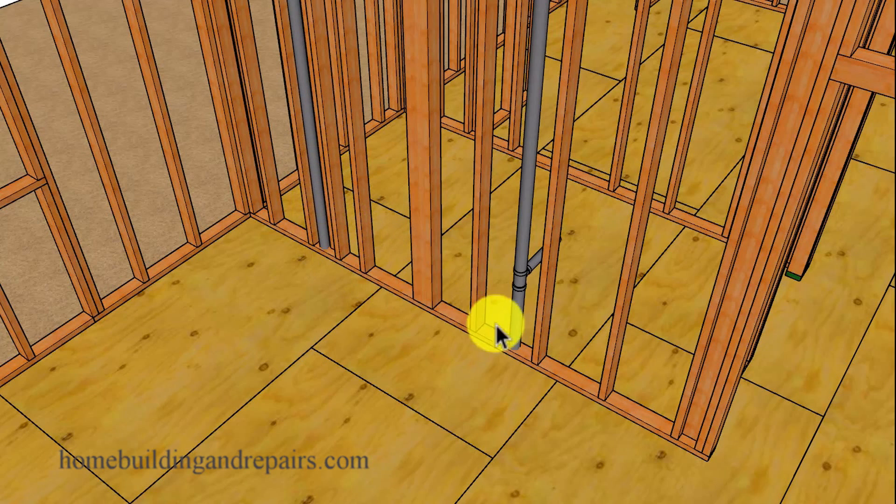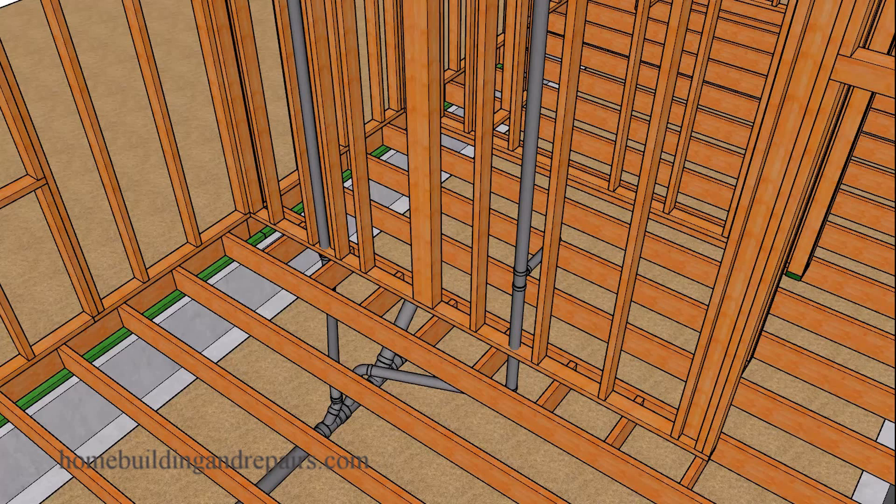Because of the amount of plumbing pipes going through the wall and the fact that the wall cannot be made any wider — and I'm not saying you can't remodel the house — sometimes by making the wall wider you can add a double joist or a beam underneath one section of that wall.